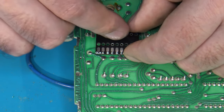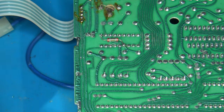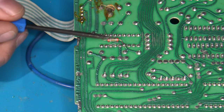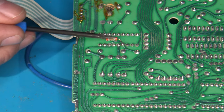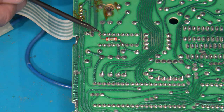And then it would just basically sit above where this QSB is, and then you've got your access to the pads where you need to solder onto. Something else to keep in mind with the QSB board is that with the orientation here, you have to remember that the way you're looking at the board right now, everything's kind of laid out in reverse. This is actually pin 1 of the color IC chip here.